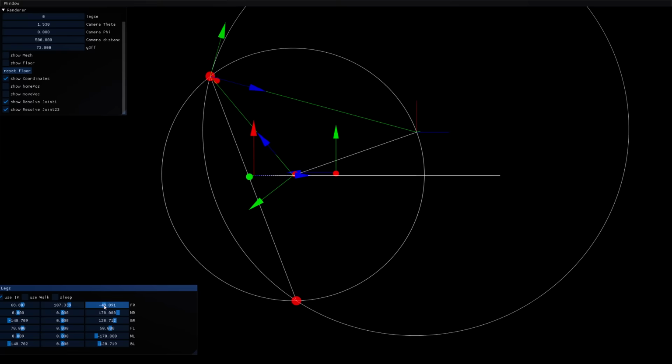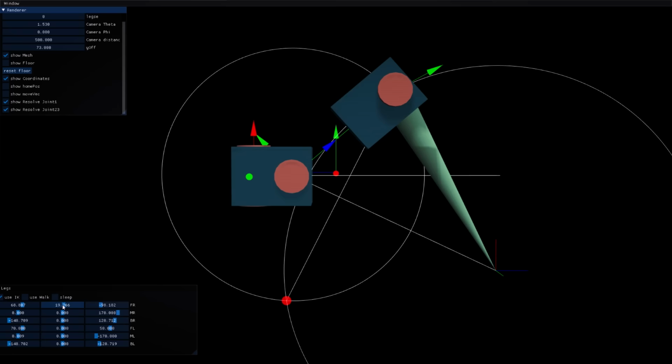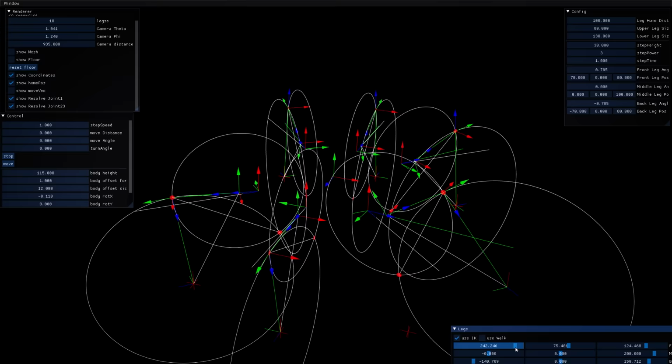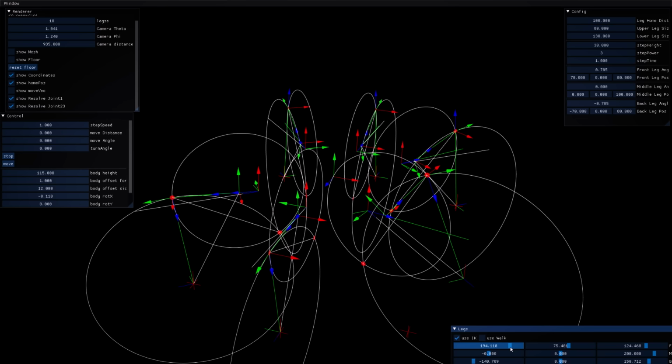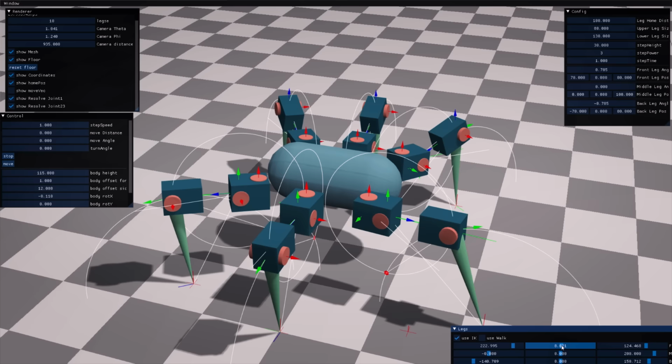Inverse kinematics can look very intimidating to program if you've never done that before, but in the end, it's just about reducing the problem in small, relatively simple 2D problems by rotating and translating your model. You should definitely try it, and making a computer model helps a lot, so you can visualize each step and make sure it's correct. Doing this with a real robot would be a pain. And if you've done it once, you can do it for almost any kind of robot arm with ease.